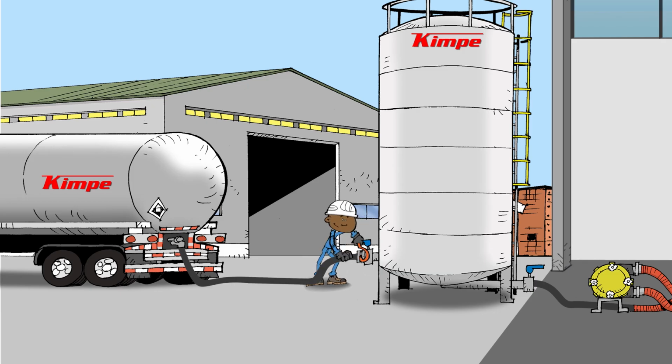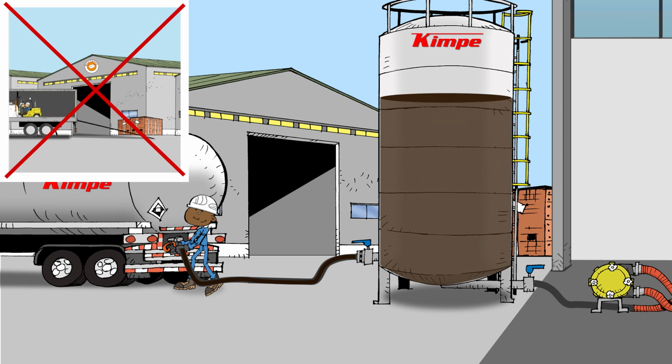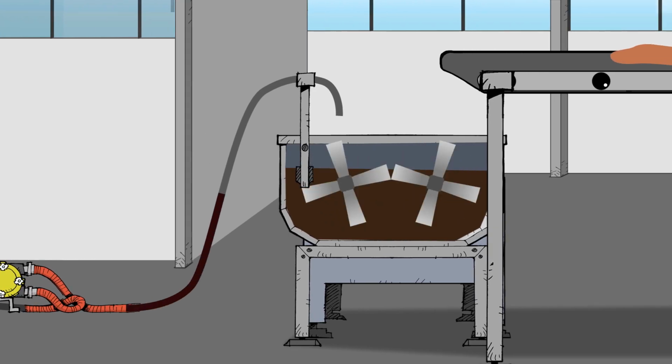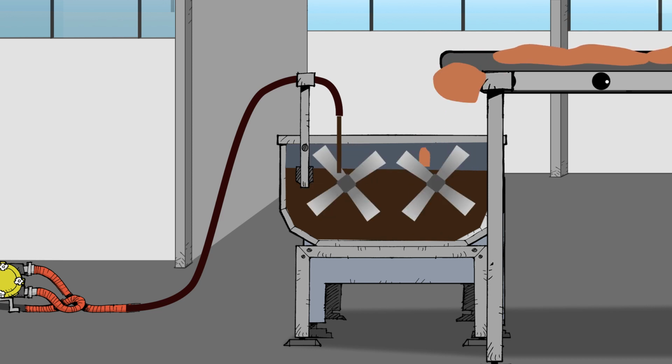Its unloading is easy and requires very little manpower, just as its use, which also brings an increased precision of the dosing as well as a constant and homogeneous integration into the clay. The colorant is usually added at the same place as the water in the pug mill or in the double shaft mixer of the extruder.